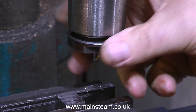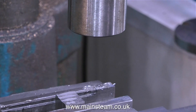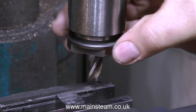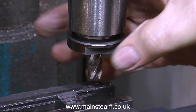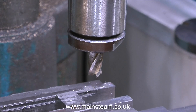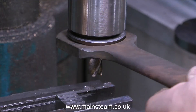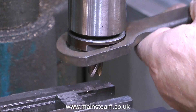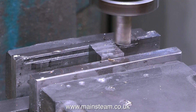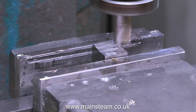The next thing to do is to change the milling cutter — this one's a little bit on the small side. Normally in this machine I use a drill chuck for milling operations, but for any serious milling operations where I don't want to destroy the part, I would always use a Clarkson milling chuck. These are very high quality devices and hold the milling cutters very securely — there is no chance of the milling cutter working loose and falling out. The collet holder is tightened up using a special spanner. If I'm able to contain my excitement, it's milling time.